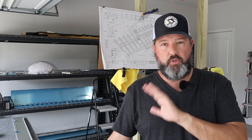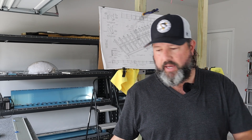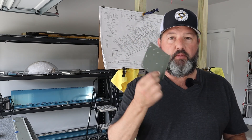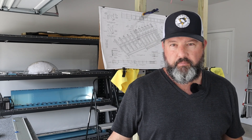I found three rivets on the rear spar on the inboard portion where the reinforcement fork is that I just wasn't happy with — I'll explain how that happens. I'll also give a better explanation of the mistake that I made with the doublers that caused me to reorder them.